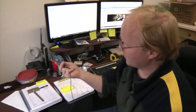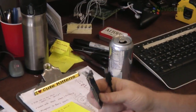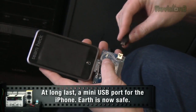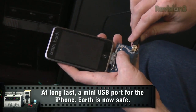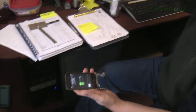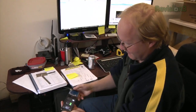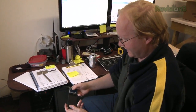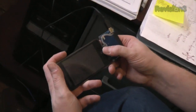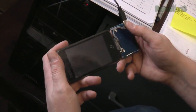I broke down the connector and attached it directly to the Bluetooth controller. I also figured, why not add a mini USB port? You just go online, look up the iPhone pinout, and you can find all the connections. It's connected. So what I'm going to do next — this is an iPod Touch, but we're doing this for the phone — is design the little button thing for your finger where you can push the eight buttons. On this side there'll be the D-pad. Now it's onto the computer drawing.